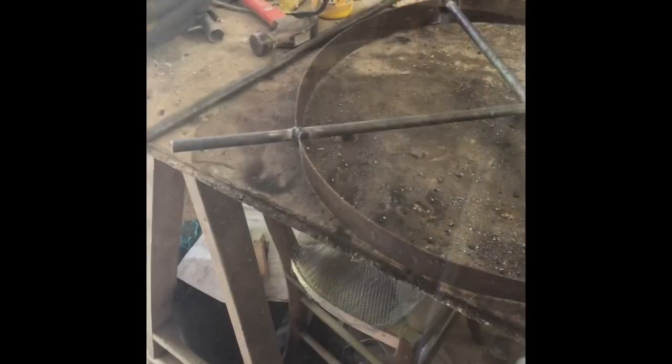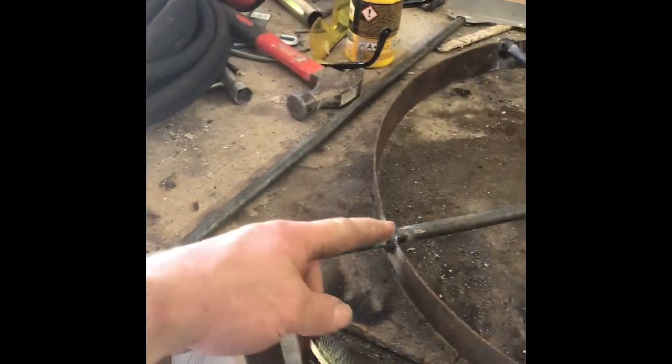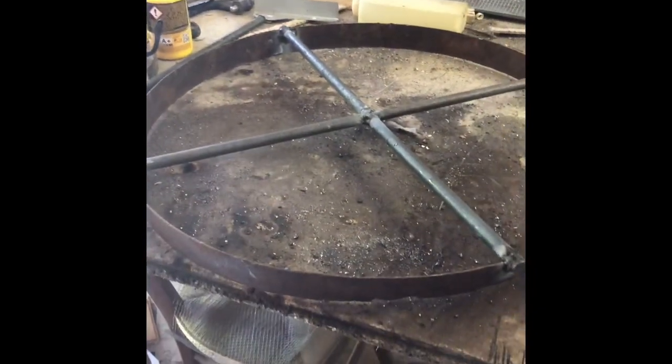We've finished installing the first bar. It is quite a light metal so I did blow through it once or twice which I've just re-welded — it's tacked in place and it's fine. We've got a couple of cross members. What I've done is just shape the end of this bar with the flapper abrasive wheel so it sits neatly within the ring and we've got more surface area. We'll make this connection and then do the opposite so we'll have a grid. Here we have the cross members now installed into the ring frame, with the connection point for the tube and a couple of circles going round culminating in the final ring.